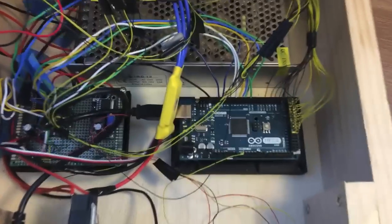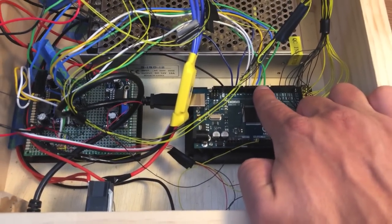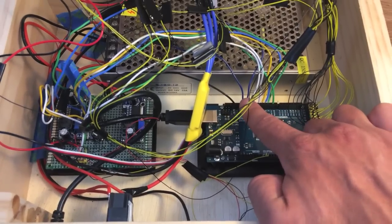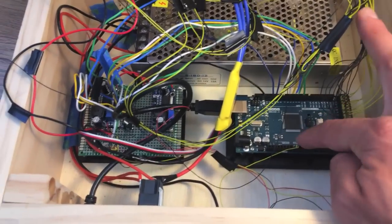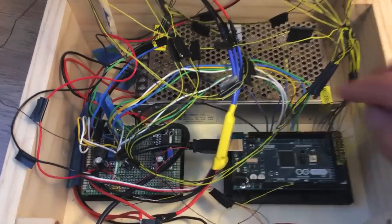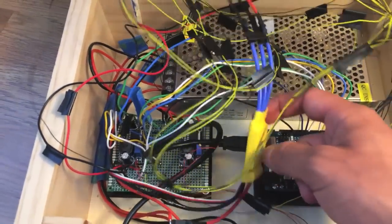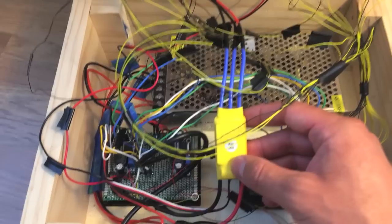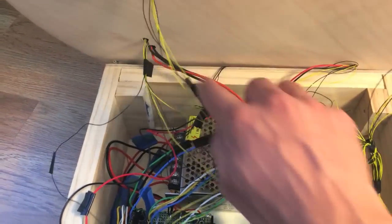Back inside the box, also connected to the Arduino are the control pins for the laser and the servo, as well as the MIDI output — that's where the sound is coming from. There's also an analog input from a trim pot used to control the speed of the brushless motor. In the back of the box is the 12-volt power supply, used to power the electric speed controller and the brushless motor, with cables run up through a hole in the plywood.